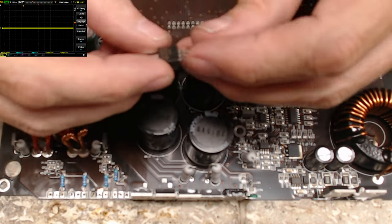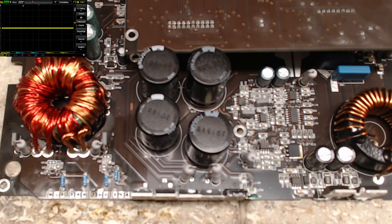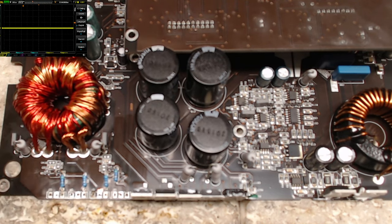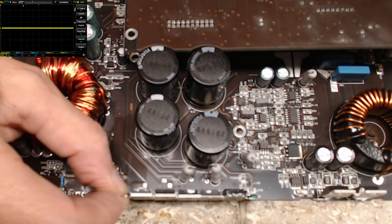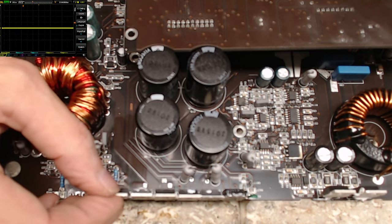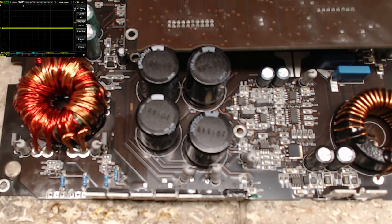So I'm going to take my 3205s and pinch the legs together just slightly. What that's going to do is discharge the capacitors. I use my tweezers to discharge the capacitors. I wasn't worried about current because these capacitors aren't the biggest, so I didn't think it would melt my tweezers. But I do not like to install new components if there's capacitance available, because you could damage the gate path of the transistor, in my opinion the most sensitive part.